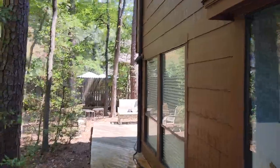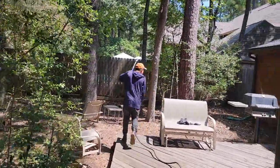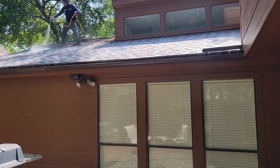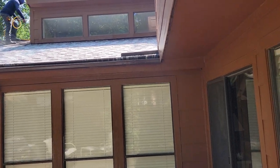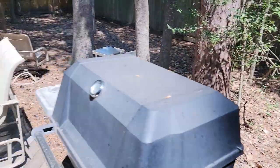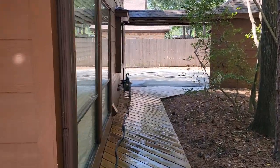I get very excited when I'm doing sprays and I don't always record them because sometimes we're busy. But whenever I can do a video, I definitely jump on it. I'm going to walk around the back. He has a reverse curve system in the back — it's working fine for the roof mask, so I didn't recommend taking it off. But when we go to spray, we have to rinse all that stuff out, because even though it's an all-natural soy oil, you don't want it sitting inside the gutter. So you rinse it out and capture it with the downspout sleeve or sock, then turn around and capture, contain, and dispose of accordingly.